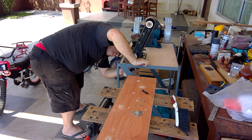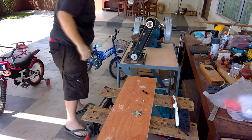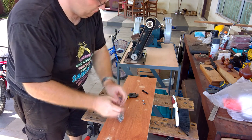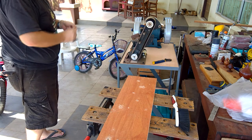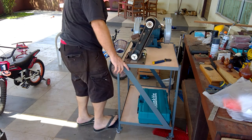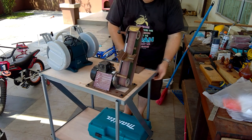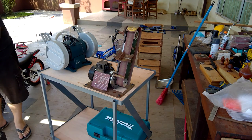There's a lot of damage that could be done through ignorance or carelessness when welding, or with any sort of woodworking tools that I also use, and I don't really feel that the risk of injury is any greater using a welder than using a jigsaw, so long as you use a welding shield and gloves — because those are the two things that are going to get hurt the most. If you don't use a welding shield you're going to hurt your eyes, and if you don't use gloves you're going to burn yourself. It's that simple — you are going to burn yourself because it is really tempting to pick up a piece of metal you've just welded and have a look at it. So wear gloves.